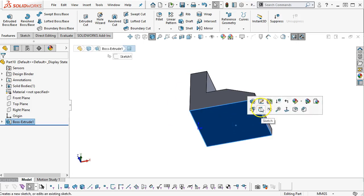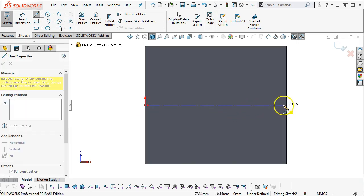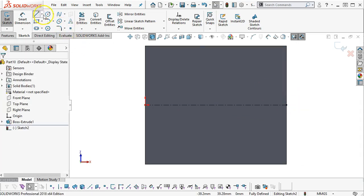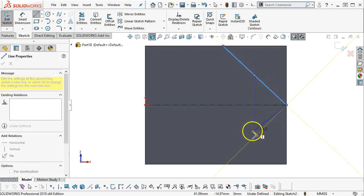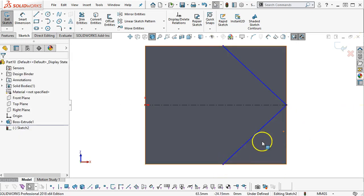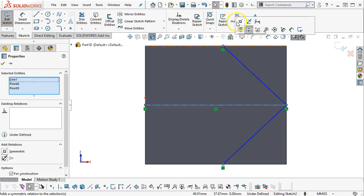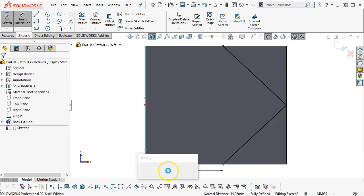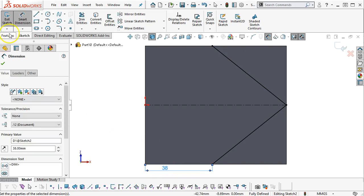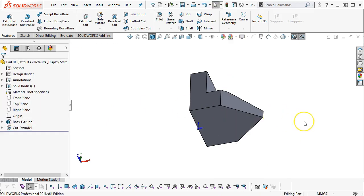And the bottom will be about as easy, so open up the sketch, origins on that side. I'll set the center line so that when it comes to a point, no, we could have gone midpoint, midpoint, and stayed with the vertical. Symmetric works. 38. Alright, and then features, extrude cut. Make sure we're setting the side to cut, and this is going to be a through all in condition. Go ahead and accept.